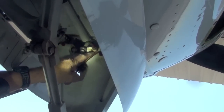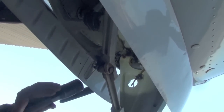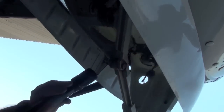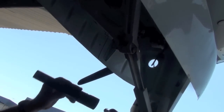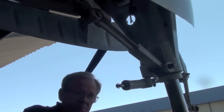This is what we call the yoke bushing. This attaches the steering linkage to the strut to steer the airplane. If you'll notice as I move it here, see how the whole thing's hooked together? There's a bushing right in here called the yoke bushing. And if you'll watch this right here, it'll pivot. I see how it moves. There's a bushing in there that needs to be replaced too. See how much play we got in that? Okay, let's check the front. The yoke bushing is worn, Y-O-K-E. So these are all things that are okay at annual, which is a couple months away. Yes, sir. Right, he'll do that here.